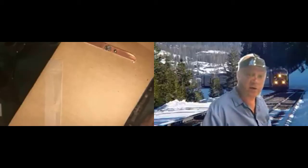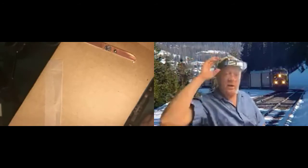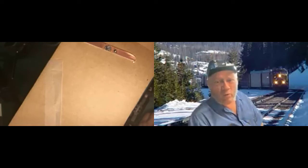Rework comes from years back working for Hewlett Packard when I was a line tech back in the 80s. Rework makes rework. You don't want rework as a habit because your rework may cause new solder bridges. It may cause a component that was heated during the initial soldering to fail during your rework. So yes, you can do it, but don't figure that that's a regular part of your process. You don't want the rework to be a habit.